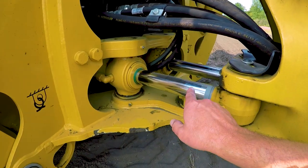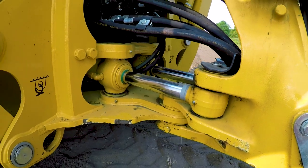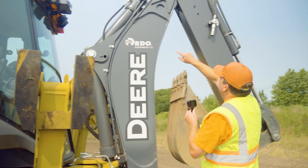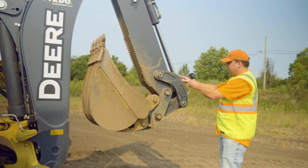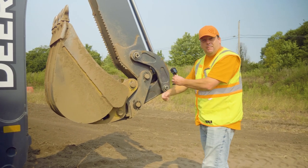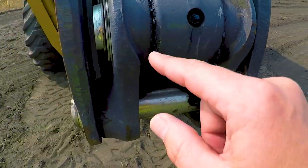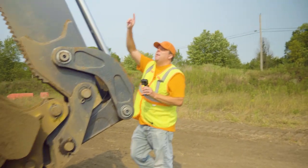Checking the hydraulic cylinders — looking around the seals for any leaks. My boom lock is intact and looks secure. Looking up along the back of the boom arm, following those lines all the way up to see if there's any damage. Making sure all the pins are secured — if a cotter pin were out, it could work its way out. Also checking grease levels at the joints; if it looks really dry, that's something you'll want to address.